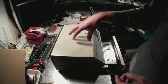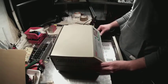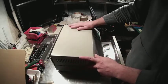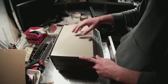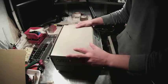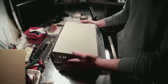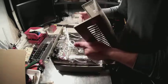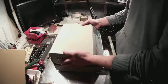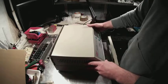The reason for the overshoot is the fact that no cold junction compensation is added in the actual oven. This oven assumes the cold junction temperature is 20 degrees Celsius, which is very wrong because the control module is on top of the actual oven and you might have a little more than 20 degrees there.